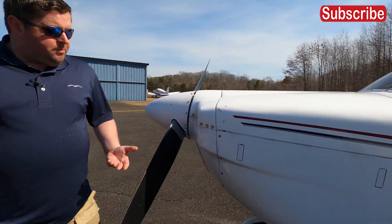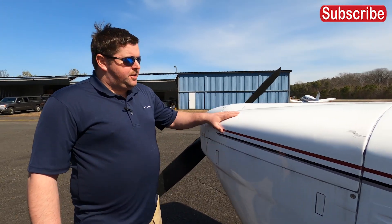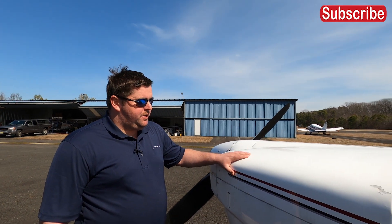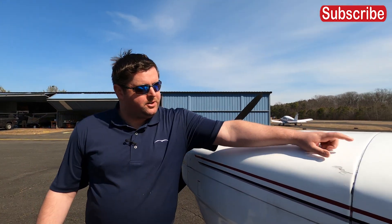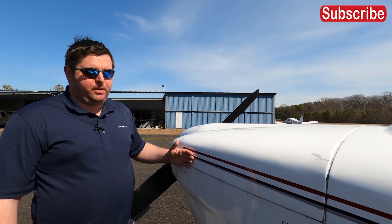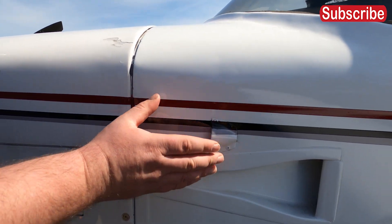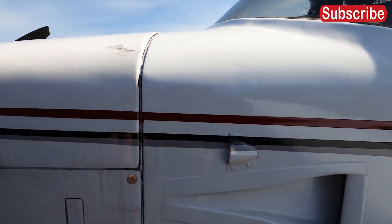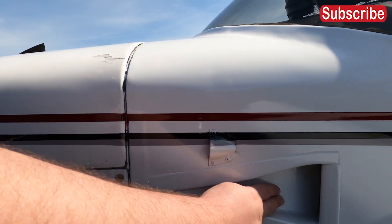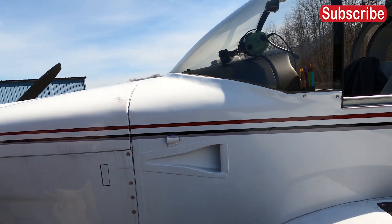Making my way over now to the pilot's side of the nose. Not part of the checklist, but on the first flight of the day I will inspect this pilot's side cowling — just because the brake reservoir is up here, I can check brake fluid, and look for anything of concern in the power plant. Then here is our avionics cooling fan, which cools the radios — I just make sure it's not covered. This is also a fan for your ventilation so you don't sweat to death on a hot day.